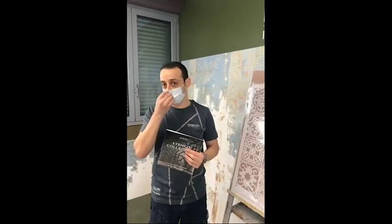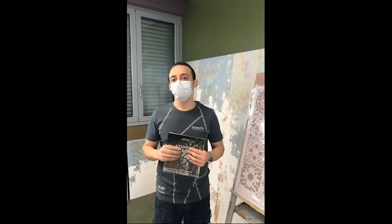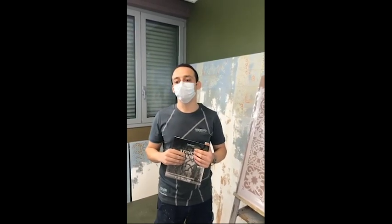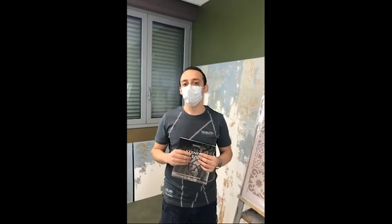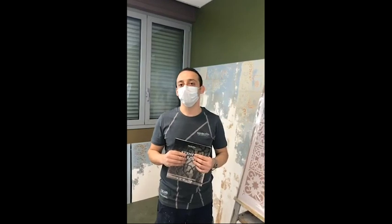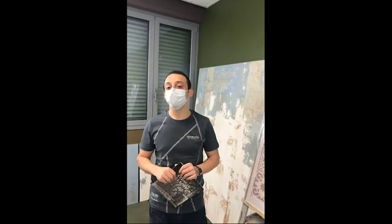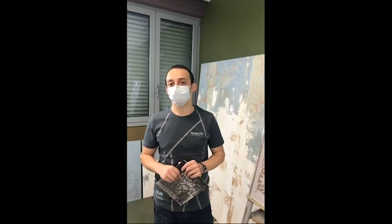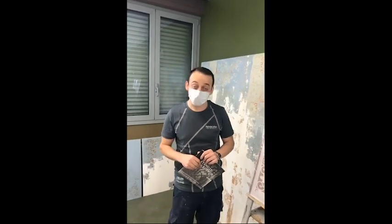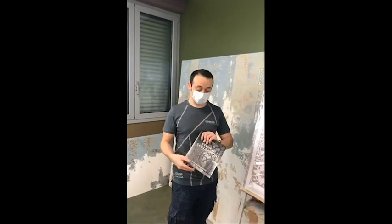What Harold is saying today is that calce cruda is also not releasing formaldehyde in a closed environment, which means there is no solvent release. At the same time, it is also reducing whatever formaldehyde is released, for instance by furniture or by other paints. It's a very active product because it encapsulates whatever solvent is contained in a closed room. We think of calce cruda as aesthetically beautiful but also quite a technical material.